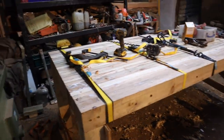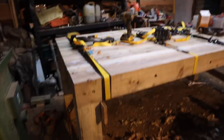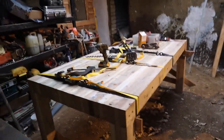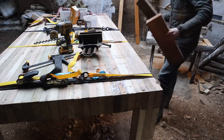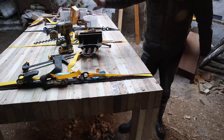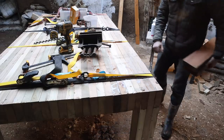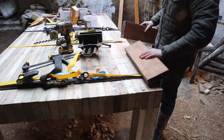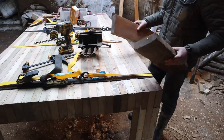We're all glued up. For the last pieces I stuffed them in there with loads of glue, ratchet strapped, and then we've got fairly long screws going through, so we just need some drying time. While that's doing its thing, I'm going to process the materials. I'm going to have a vice on the left corner — I want a clear run for the saw, so I don't want the vice getting in the way. I'm going to put a vice here and a tail vice up here. I've got these old offcuts of sleeper and I'm going to use those.